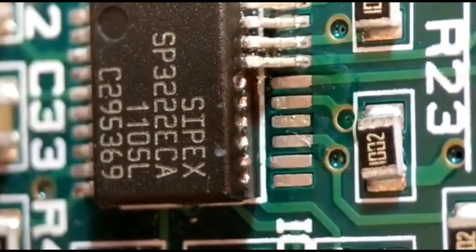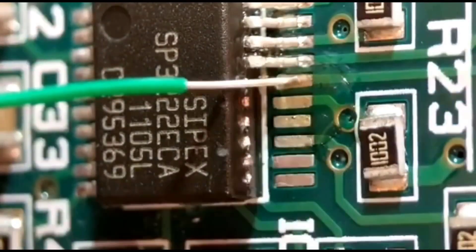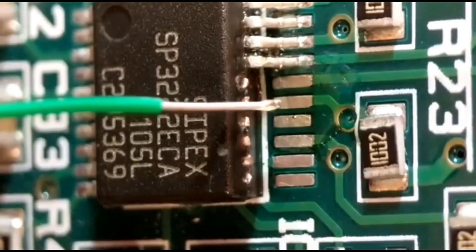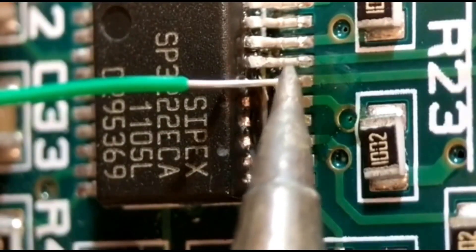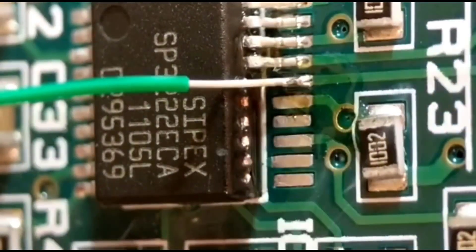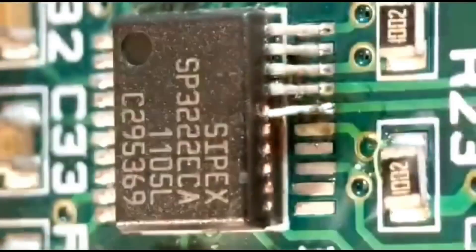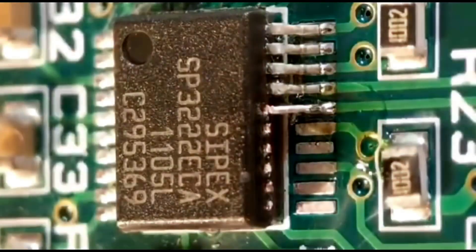Now we come to fitting the first three using the wire link method. I'll put a little bit of flux on — this is my old trusty Kynar wire that I use for a lot of my mods and fixtures. I'm literally going to solder that onto the pad in place there. The best way to do this: get a scalpel blade and gently ease that into position. There you go — you've got a nice little bridge there for a nice join.